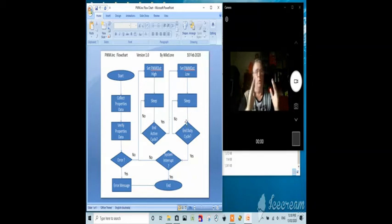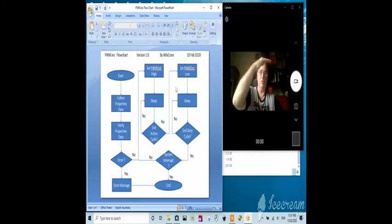So what we're doing is we're saving power. We're being really efficient with the chip. Now that's as good as it gets in terms of what I know of. There's probably other ways to do this. That's my way of doing this. So turn the pin on, put the chip to sleep. The power is basically running through a switch. We've used the chip as a switch. Chip's gone to sleep, turn the pin off. Chip's gone to sleep, turn the pin on. Chip's gone to sleep, turn the pin off.